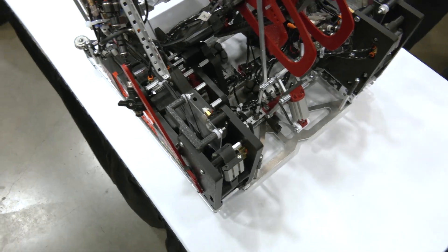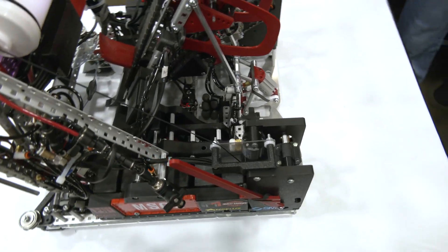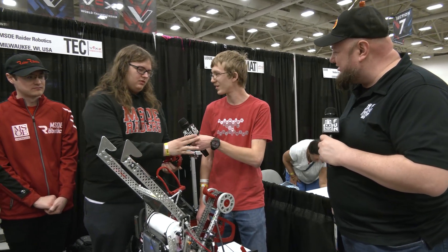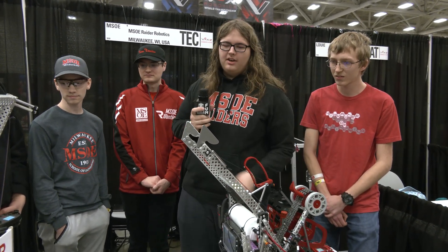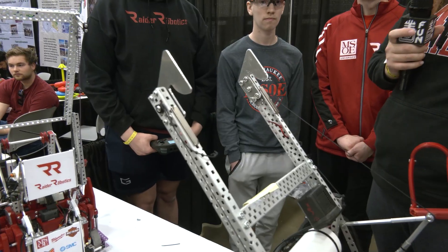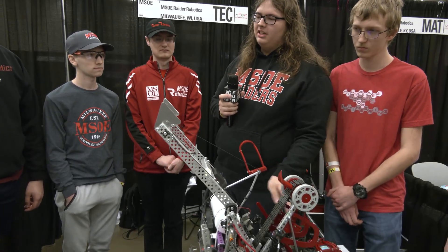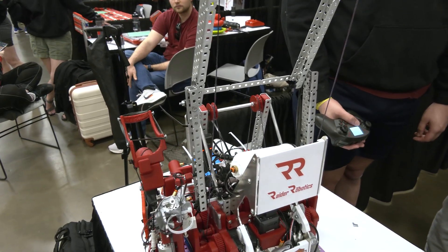When I watched your match and saw that bar come down, I was a bit skeptical — it kind of looks like a trapeze bar swaying. How much practice went into actually getting the robot to line up and score? The lineup isn't actually that hard because there's a lot of play in that bar as well as having magnets so that the bar snaps into place. The hooks are also designed with quite a bit of play. However, if we're too far to the left or too far to the right, the bar won't be able to get between the climb bars and we could only get a maximum tier two climb, which is still a fair bit of points.